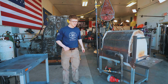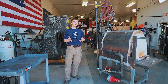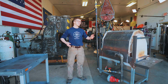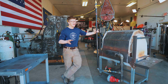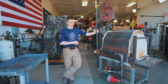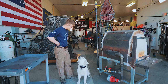It is fantastic to have you here on this hodgepodge of an episode where I want to do some more of these maintenance projects on the new tools that we've acquired, such as the forge and the power hammer. You'll remember last time we tried the forge, we couldn't quite get it up to temperature, and the hypothesis was we couldn't get enough air at a high enough pressure to get the amount of gas that is required to mix properly and burn at the right temperature. So trying to get this forge up and running is objective number one. Isn't that right? We're gonna work on the forge.